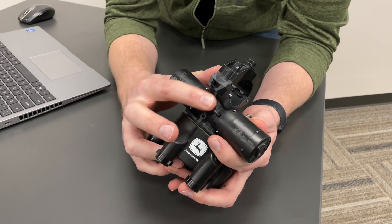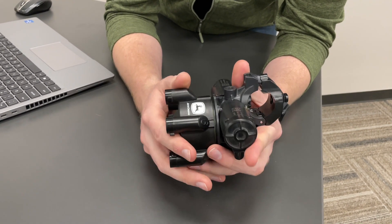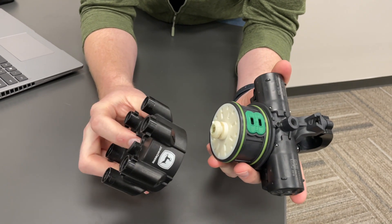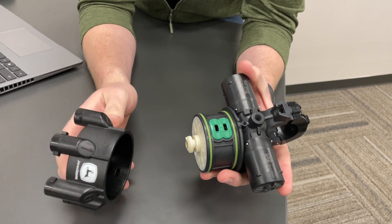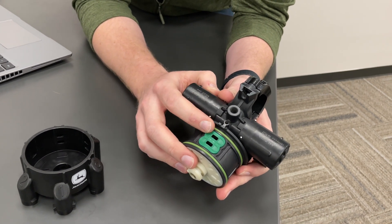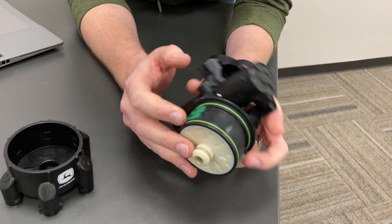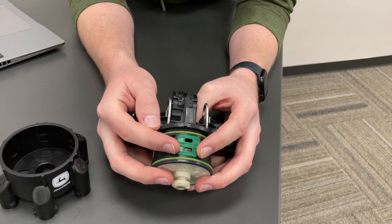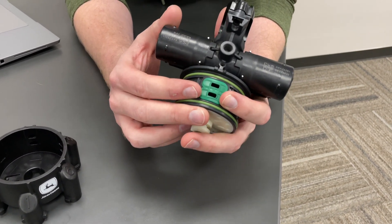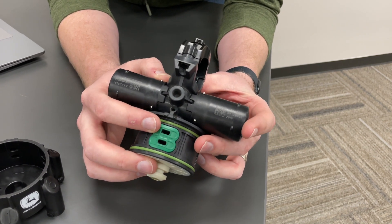The front of the nozzle body is where this little pipe is coming off the front. The back is easy to identify by the connector. To describe the modes, we can remove the retention clip and pull the turret off so we can see the ports on the front and the back of this nozzle body. On the front, there are two ports and they're both open, so product can flow out of either the top port or the bottom port. Versus on the back, the top port is the only port that has an opening and the bottom port is plugged. The bottom port on the front ties to the A side solenoid and the top port on both the front and the back tie to the B side.